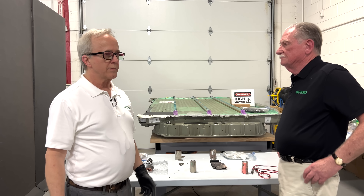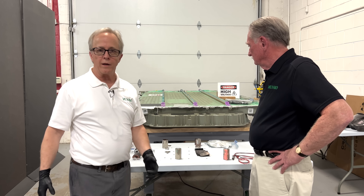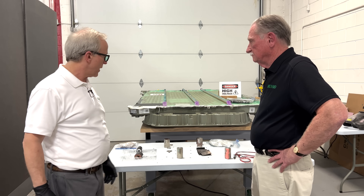Those welds go through the end cap — the ball bearing is at the center, and the foils from the anode are directly welded to this cap, whereas the gen 1 had an intermediate device for that functionality. This is a reduction in components and cost, and it freed up space inside the cell, giving them the ability to increase energy density — which our tests should hopefully confirm. Tesla has made declarations about their improvement in energy density, and we look forward to confirming those numbers.